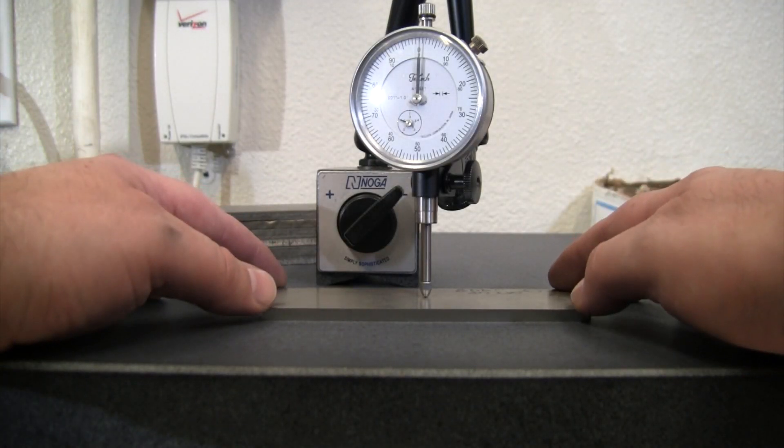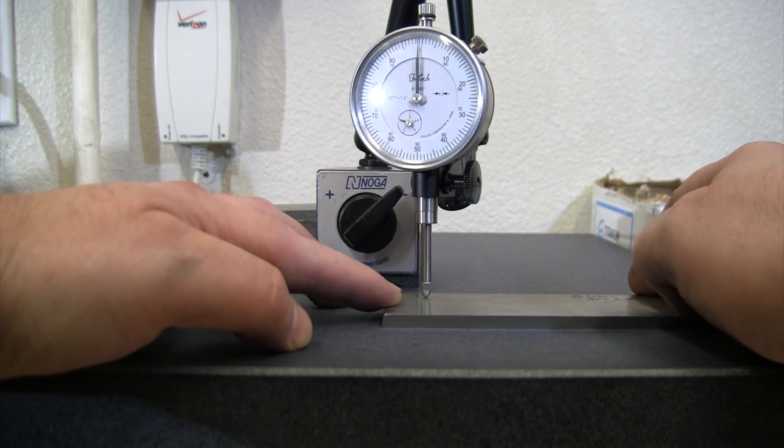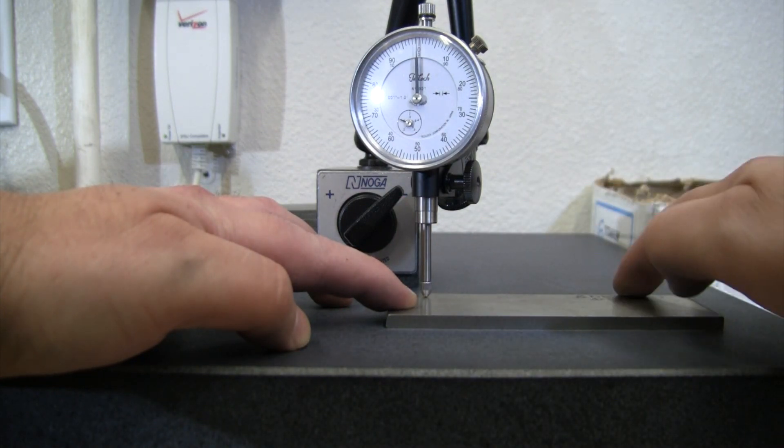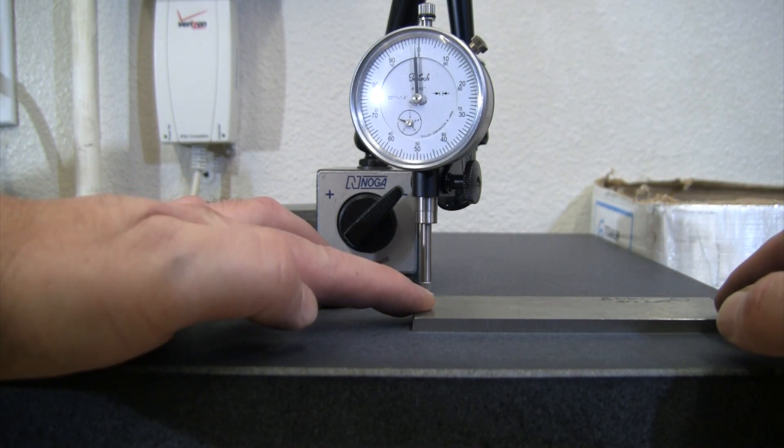From the reality of that first batch, I've already cut many of those plates and they all cleaned up within that five-thou cut, so even though the spec allows plus or minus ten thou in thickness, I don't think you'll find material that varies that much in practice. But you do need to be aware of the standards and understand the tolerances they can operate within. Let me turn the camera and zoom in on the surface plate — I'll show you exactly what I experienced, the difference between the saw-cut material and the sheared material.